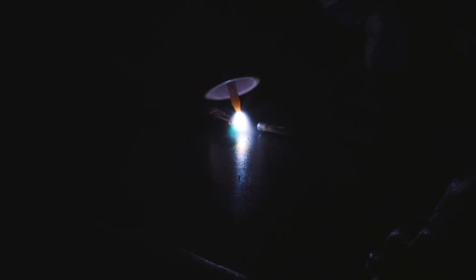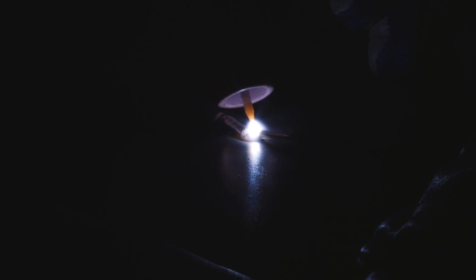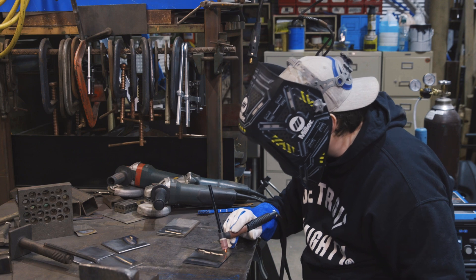Here — too cold. If you have the wrong angle, it'll just ball up. It won't want to take into the metal until you kind of add a little bit to it. But then you start doing it too cold again and it lumps up at the end of the rod and gets kind of nasty until you even it out again. See how it balls up there? That happens when you don't have a good angle on the workpiece either.